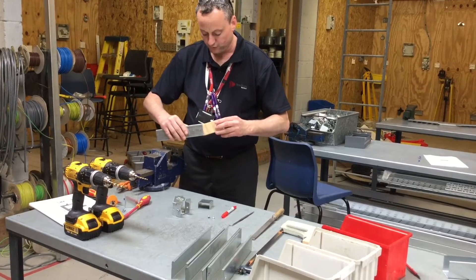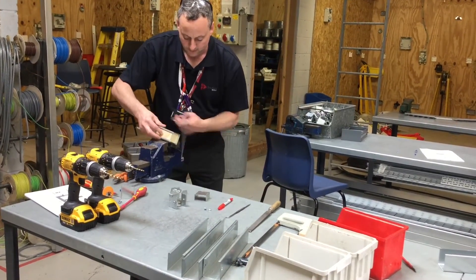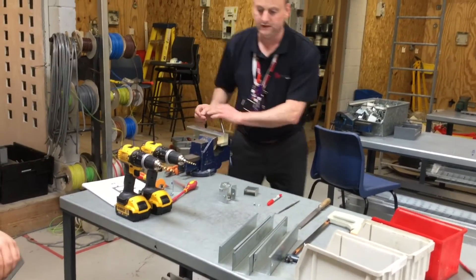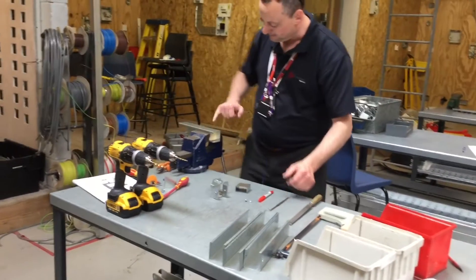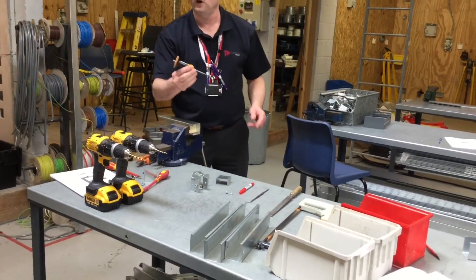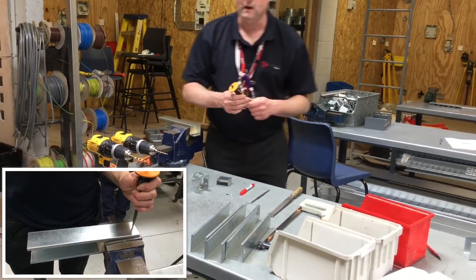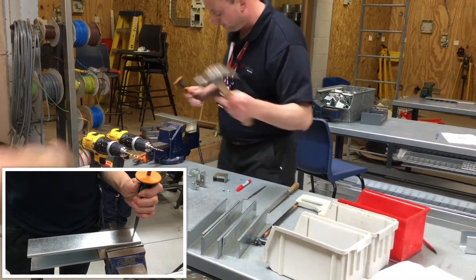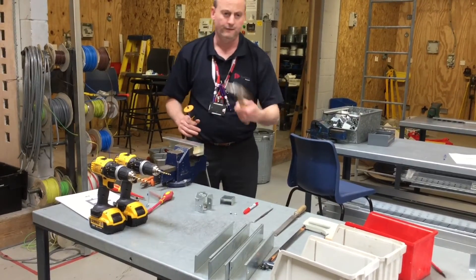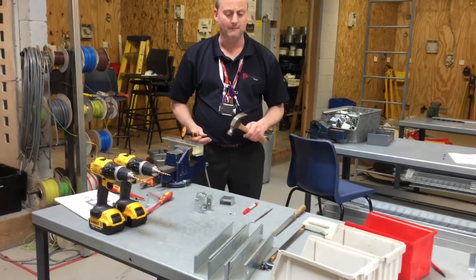I'm placing a piece of wood inside my trunking so I can put it in the vise. I'm going to drill first a 3mm hole and follow it with a 6mm hole, which I've already set up. To make sure I get in exactly the right position, I'm going to use my dot punch — if you can just pass me a hammer as well. I'm going to make a dot punch hole so I've got the start position for the drill: 3mm, then 6mm. Flick it over, do both sides, file it up — end cap finished.